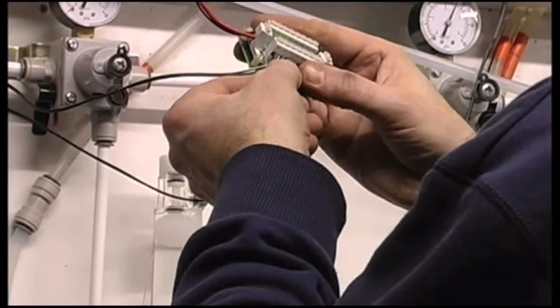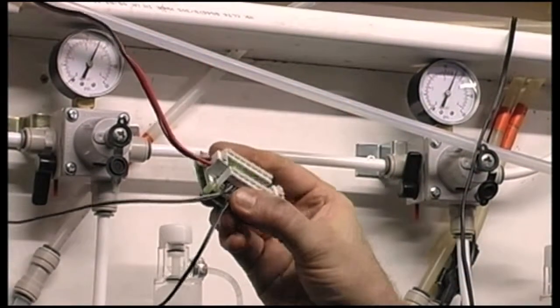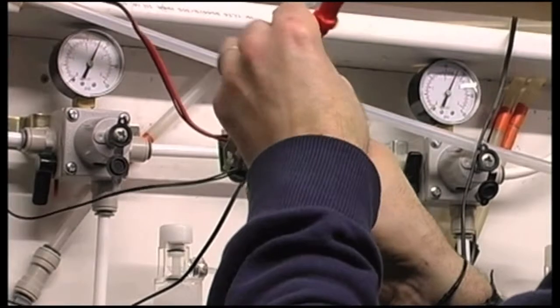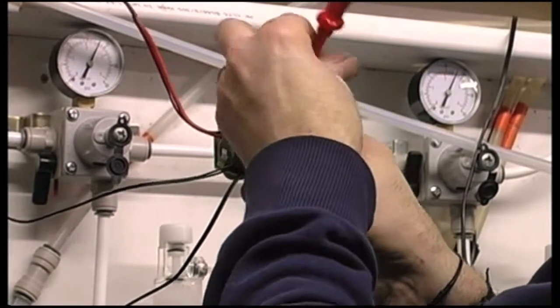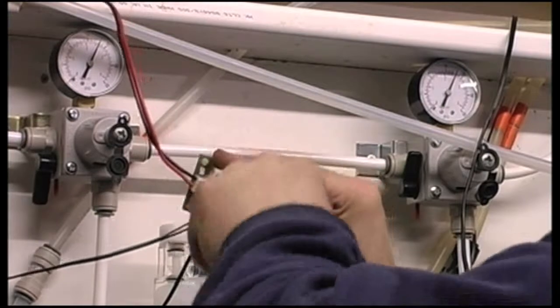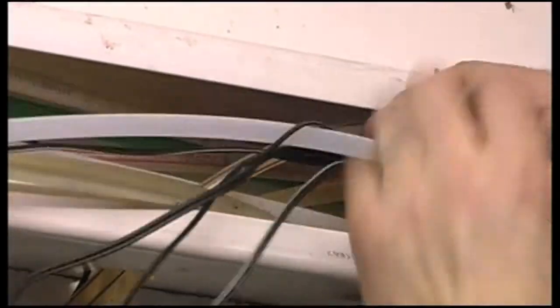Please tighten all connections with a good headed screwdriver. Again, this process is continued till all units have been correctly wired to the block. Each block can take up to 18 units safely by doubling up on the wire for each BeerTech conditioning unit. However, if the kegs are in various parts of the cellar, it is advisable to add more power distribution units rather than run wires through the cellar.